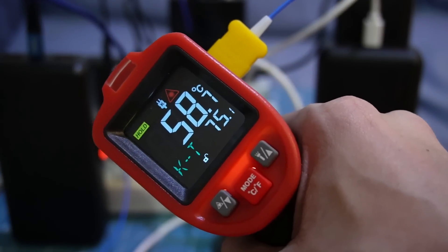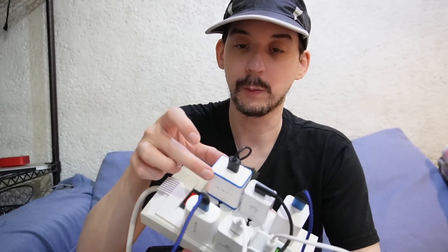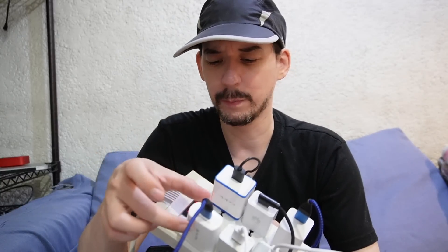So that's also pretty hot, but not quite as high as the Bavin — or alleged Bavin — which is 75 degrees Celsius. It's been 6 hours, and surprisingly all of the chargers are still outputting power. They are too hot to touch — if a child touched this I think they'd burn themselves. The Bavin reaches 85 degrees Celsius. I'm pretty sure that all of these are fake, except the Bavin — I think that is genuine. But they do technically work, just not what they promise. Most of these say they can do 2 amps or 3 amps; in reality they can only do 1 amp. Although they haven't exploded or broken yet, I don't think they're going to last very long. Imagine if this is reaching 85 degrees Celsius — you can feel the warmth coming off this, you can smell the electronics. It smells like burning. How long will it really last? My guess: not that long.